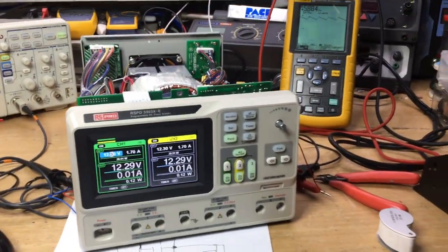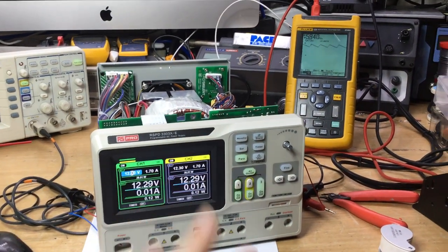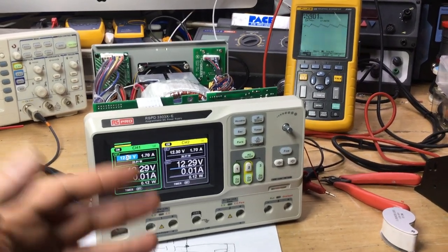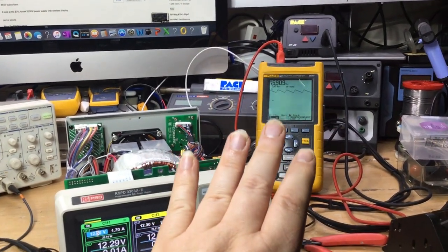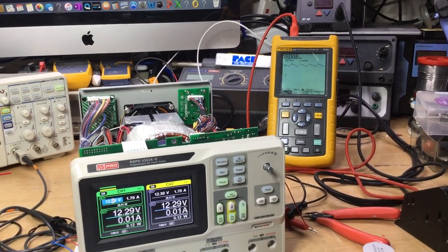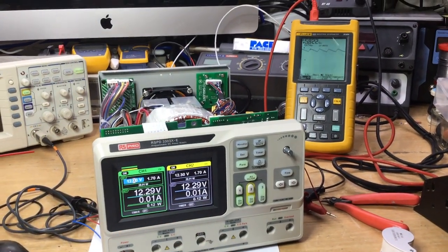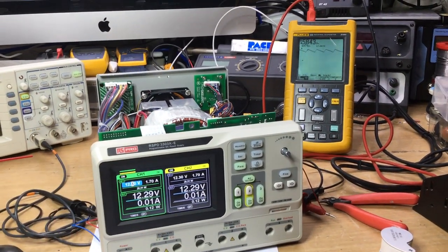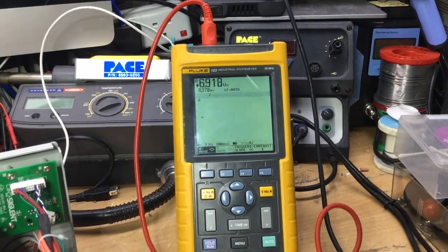So now, one of the things is as well, once it clicks off and it goes down to say 2.9 volts or thereabouts DC, when I switch the supply off so that I'm letting everything discharge down, the discharge rate of the reservoir capacitors from 2.9 volts takes several minutes to discharge below 0.6 of a volt DC. So if it was a short circuit or some faulty component, unless it's voltage related of course, but say it was a resistive load because of something like a tantalum capacitor going short or some other problem, there we are, it's gone. Once it gets down to that, then it'll come back again.